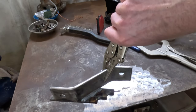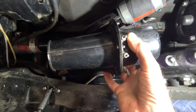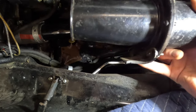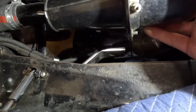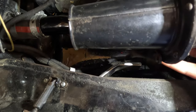Definitely overkill for what it is, but I want to make sure there won't be any flex and I don't think there will be. The next step is to make the second part of this bracket that attaches the main bracket to the horn itself. I flipped this bracket over — it was originally leaning backwards, flipped it around so now it's pointing forwards — and that should line up just about perfect with the hole in that bracket. I think a narrow piece of flat metal with a 90-degree bend and one more hole drilled in it should do it.